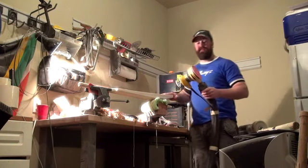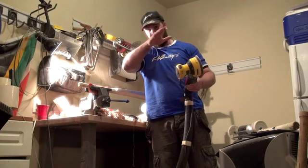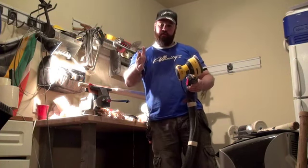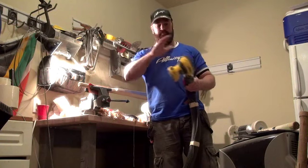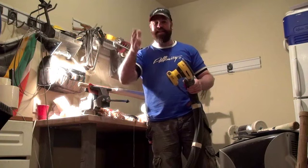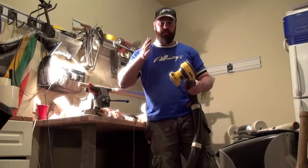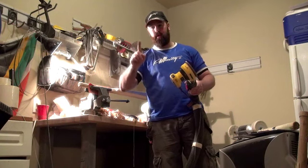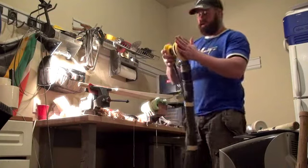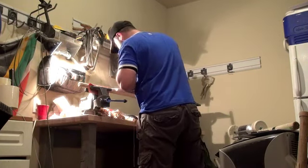Sides, you can leave the sides each time to last, because as you're turning over the face and you're also cutting into the sides, by applying a smooth sanding surface to the outside, you just neaten up. So if you've got something that's got a little bit of wobble and it's running down the edge, you can just straighten it up by just applying the sanding surface to the right hand side.